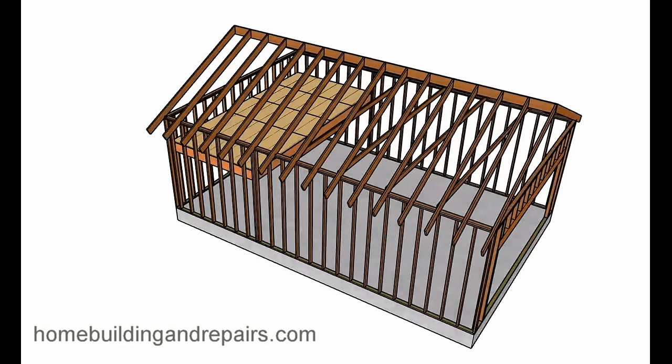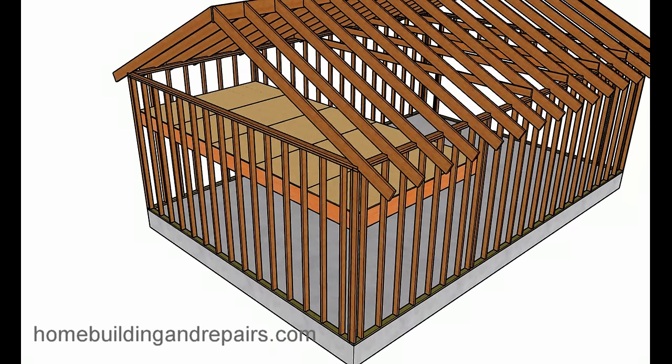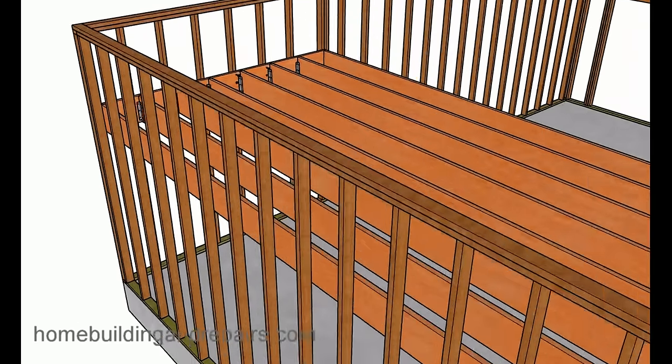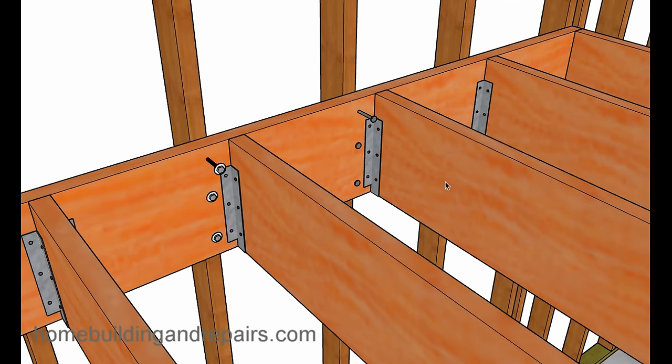In this video I will provide you with a few ideas for actually framing the loft. We'll start with a simple one here that I've already drawn. This one will require a ledger with some joists that would attach to hangers. It's not uncommon for an engineer to require lag bolts — a four inch lag bolt that would give you an inch and a half plus two inches into the framing stud, at least five-sixteenths, possibly three-eighths bolts. Another method for attaching a ledger would be using 16D nails.